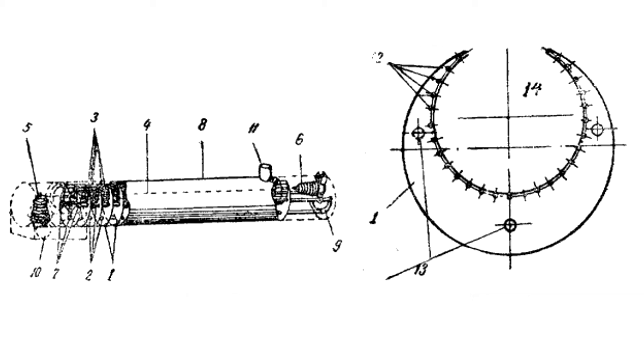The proposed electrostatic filter belongs to the type of filter with horizontal gas flow. It is designed as a drum with axial rod electrodes and dust collectors in the lower drum part. The essence of the invention is that the precipitation electrodes are located along the inner edges of the sickle-shaped plates, facing upward, rigidly bolted together, and forming dust-collecting compartments in the gaps between them.